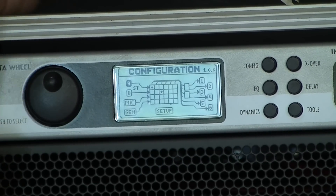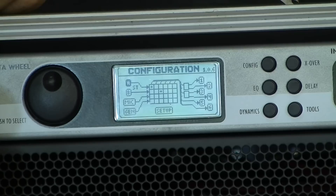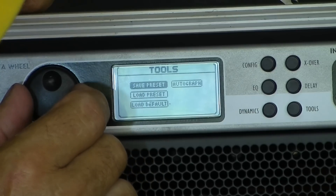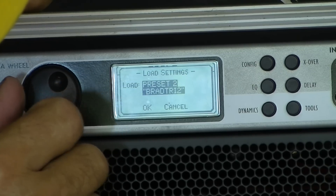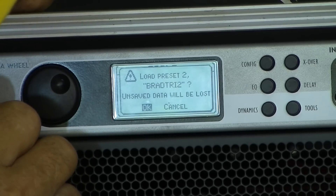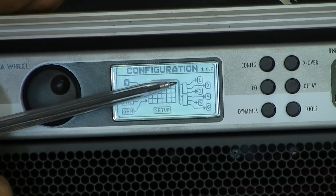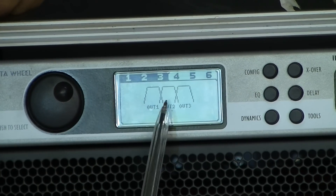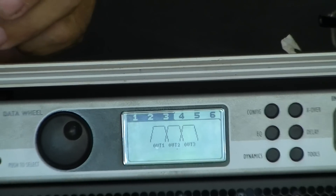At the moment, if you have a look at the matrix, you'll see two boxes showing we've got a bi-amp configuration. Today we're going to show you how to set up a tri-amp configuration. We'll reset now, go into Tools, and load the preset. There's tri-amp two — we'll load that. Into the configuration, and you can see now we have two boxes with three outputs. We'll just have a look at the crossover settings for the sub-bass, mid-range, and high frequencies. Now let's go along and have a look at how we connect up to the loudspeakers.